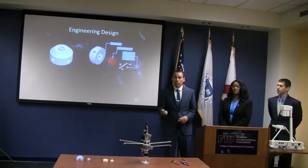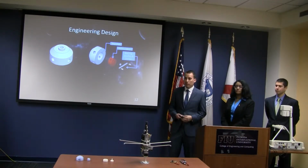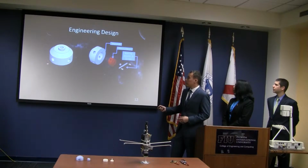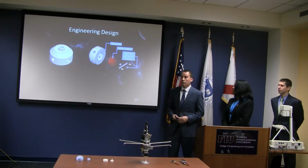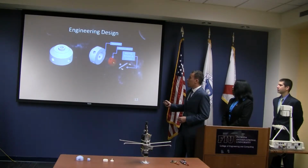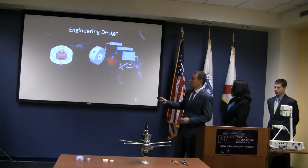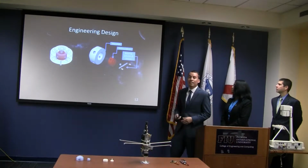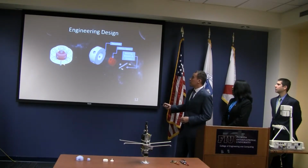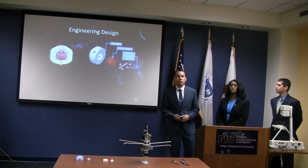Thank you to Dr. Tremante, who let us 3D print to get a broad idea of what we're dealing with. It consists of the manifold, which has one input at the top and four outputs equally spaced 90 degrees from each other. It also consists of the rotary valve, which goes inside the manifold. The rotary valve has the same input on the top aligned with the manifold, and has two outputs exiting 90 degrees from each other. These three parts were manufactured: the manifold, the rotary valve, and the rear bracket to hold the whole system together. The rest of the parts were purchased.